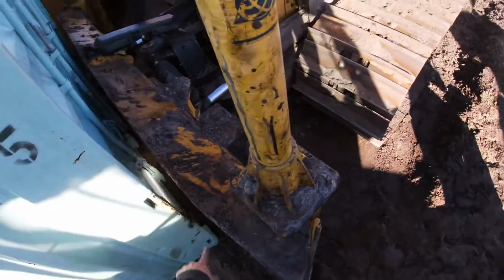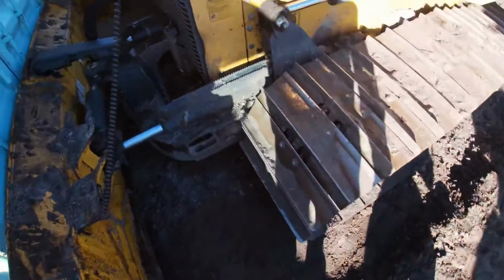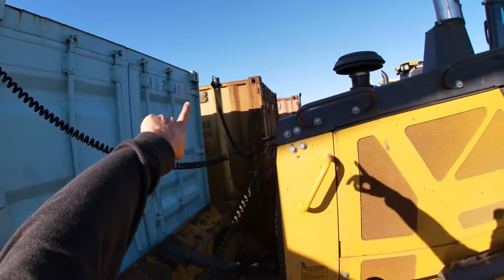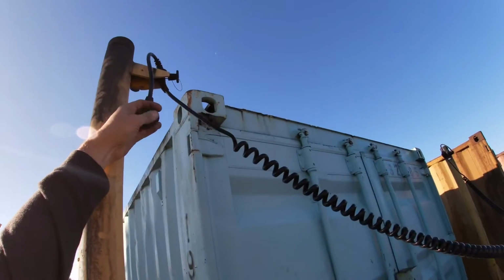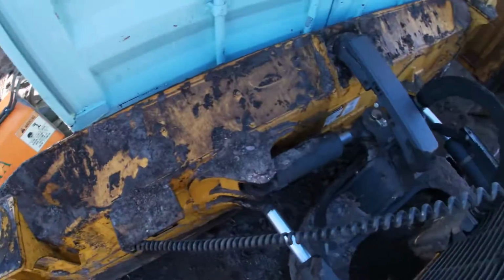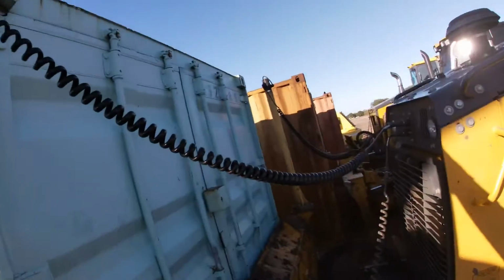I see the cutting edge looks fine. They've cleaned as much debris as they could with the shovel. Everything looks good. I'm inspecting both of the poles, all of the cables that go to the poles, also making sure that I don't have any water or debris in any of the GPS connections that are open. Most of these will have caps you can put over them to keep them dry.